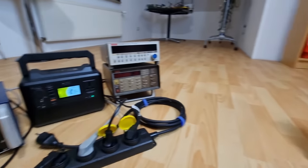Don't trust me on this — as a DC person I hardly know what a decibel is. At any rate, there are plenty of possibilities for improvements still waiting to be explored. For comparability with the rest of the list, I'm just going to add two results: one with a good and one with a bad mains power supply before it. It's also worth noting that this haphazardly constructed transformer can deliver over 5 W without overheating the driver chip — with better construction probably even more. So bottom line: when being fed by anything better than the absolute worst leakers, this is a great performer. When combined with one of the better mains power supplies on the list, the result is easily number one. But I don't like a few things about it: the involvement of 3D-printed parts, the difficult and fragile assembly, and the fact that it might still be copyrighted. So my final solution is different yet again.